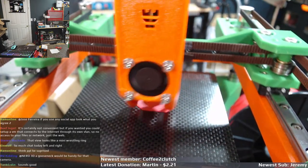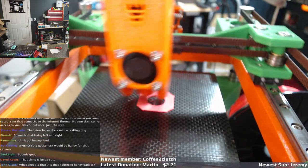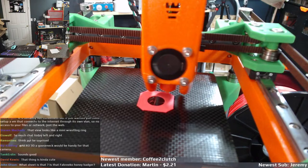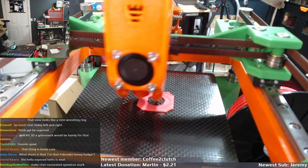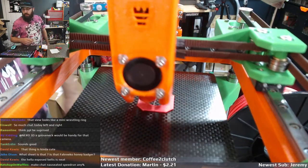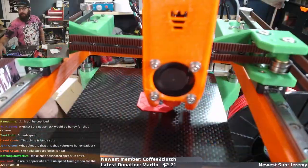I did check the Bowden. I told it to extrude 50 millimeters. It was extruding 48, and then I adjusted it, told it to extrude 50, and it pushed 50. So we should be kind of okay. We haven't done input shaper or anything. It's running stock for everything. Well, this is just a C920 on a cheap tripod. Nothing fancy.